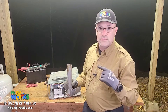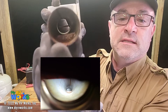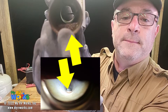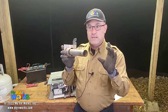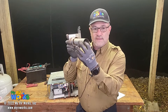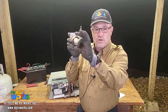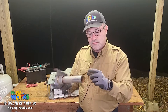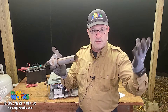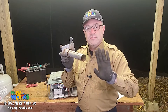I've taken a picture of this and I'll put a little picture-in-picture here. See that little bump right there? On the new Dometics, if I'm not mistaken, they don't have this little fin on the bottom — it's a little closed. There are different configurations depending on if you have a 35,000 BTU furnace, a 25,000 BTU furnace, or a 40,000 BTU furnace. I'm going to call it a donut — that's what I've been using in the field. There's like a little slot they put on here.